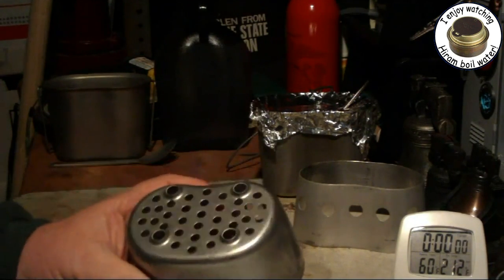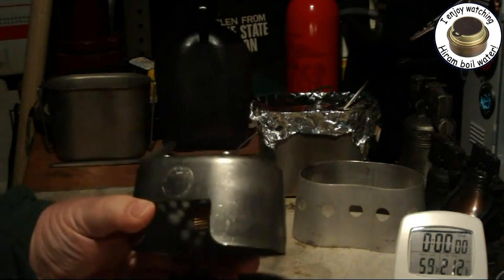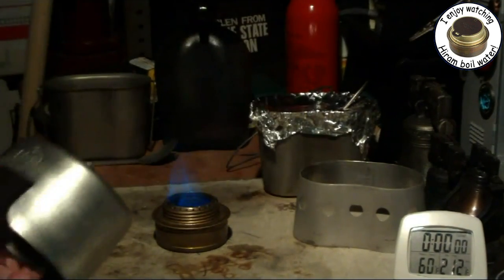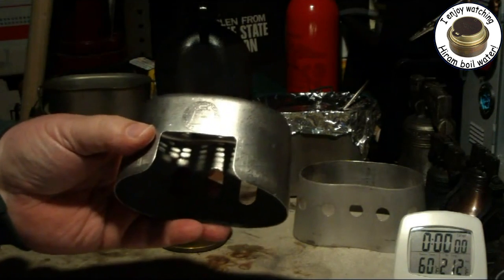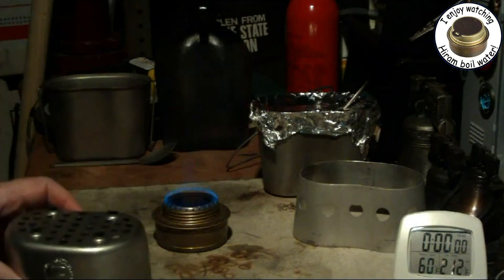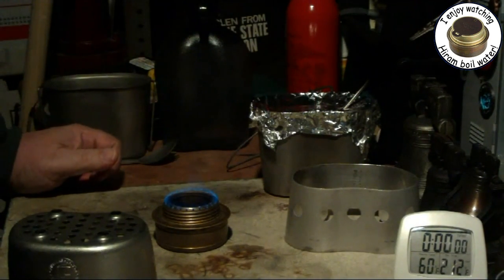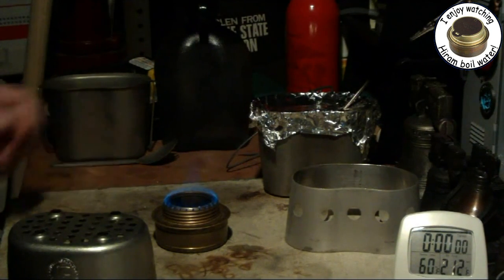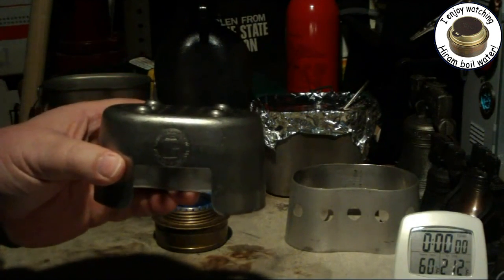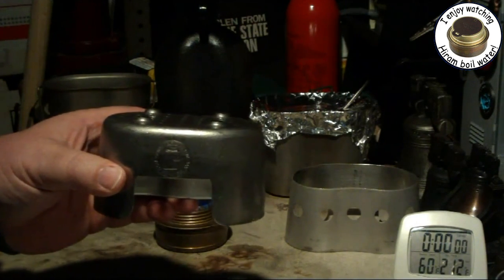While that's heating up — this is quite heavy, this stand versus the old one. They're about the same thickness, except the old one seems to be made out of aluminum and this one's made out of steel, at about 0.03 inches give or take. The weight on the old stand was 49 grams, or 1.75 ounces, or 0.108 pounds. This new stand is 165 grams, 5.8 ounces, or 0.362 pounds.